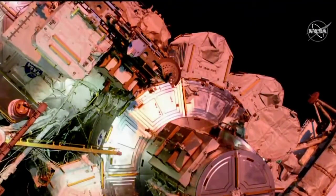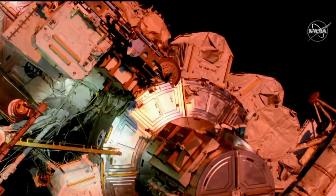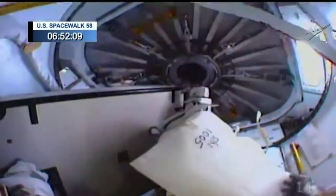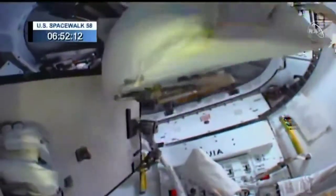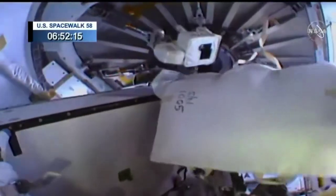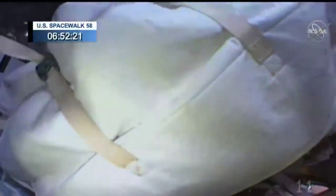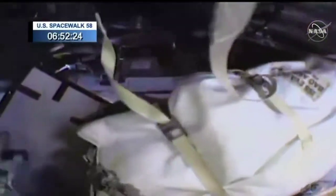Okay, I'm not sure how to have the CCDU here. It was tucking up, again, like we were talking about, port side, pins towards the wall, and I think once you're in, it will be more likely to just stay there. Yeah. Trying to get it back in that position now. Just kind of floating above the UIA, and this ORU bag is also in the way. One thing you had to fix were those scoops that are on it, they are big tether snags. So it's better not going where you want it to go. Check the scoop. Okay, copy.